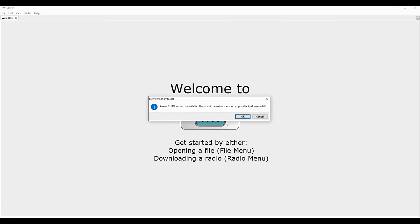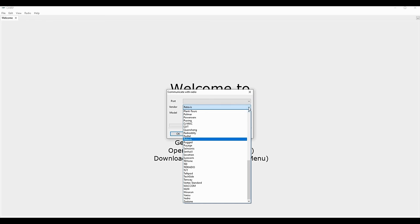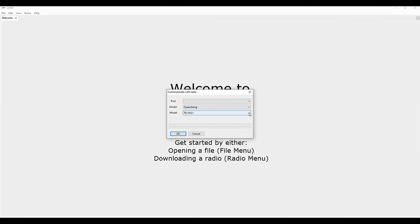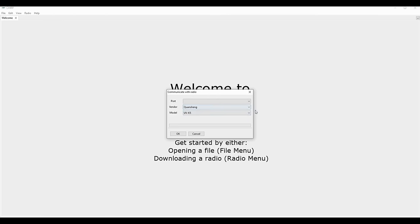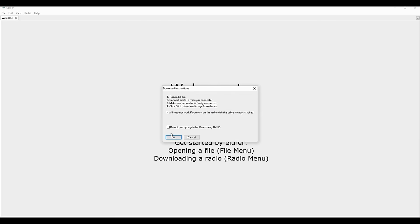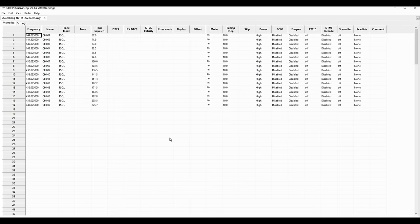Here it is - it asks for an update; I'm not going to bother this time as I know it already supports the Quansheng radio. With the radio now connected, we go to File then 'Copy from radio' so we can see what frequencies the radio has been shipped with - sometimes you get exotic frequencies that wouldn't be appropriate to transmit on. We choose the COM port - it should automatically select when you plug in the cable - then click OK. We can see we've chosen the Quansheng radio from the list, and here are all the frequencies shipped with the radio.